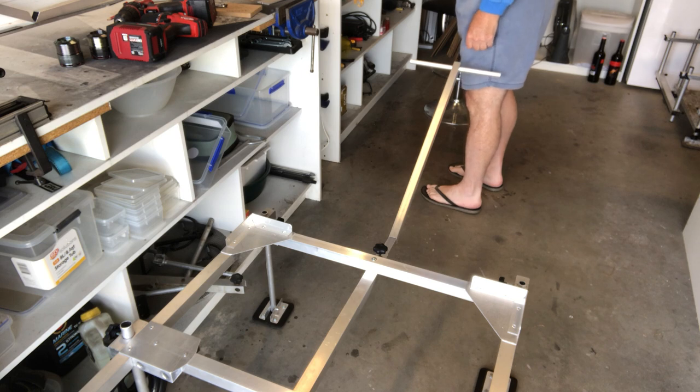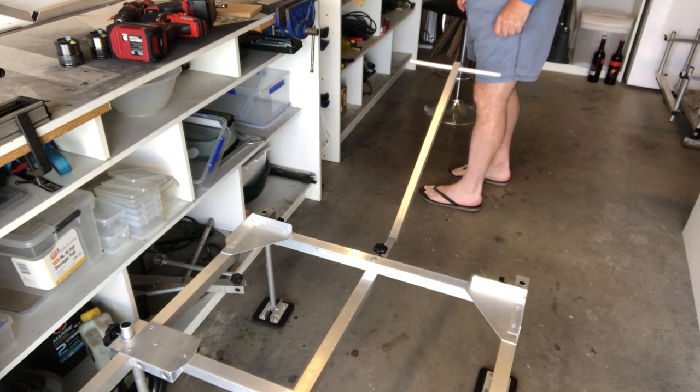That's just a fraction lower than where my hand sits, so when I lift up that seems about right to me. Now I've just got to get these side plates on to hold everything in place. These side plates are made out of 50mm by 130mm long by 3mm aluminium, and I'm just going to offer this up here and draw a line — that's what I'm going to cut to make the actual plate.